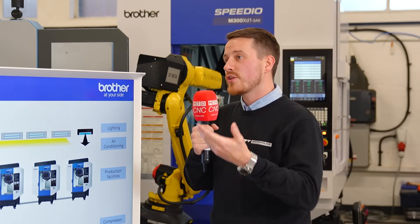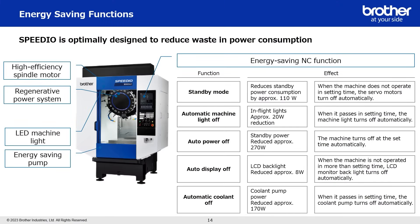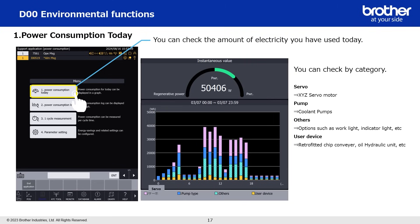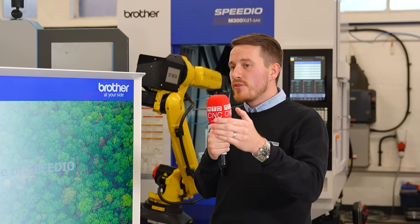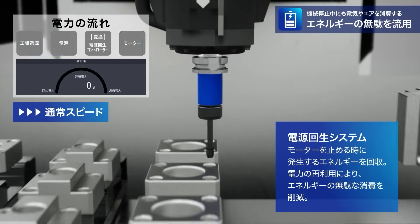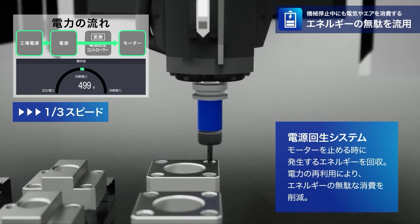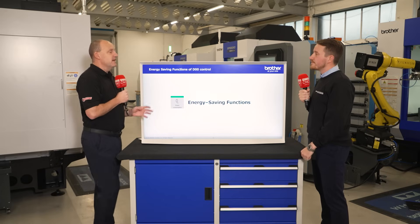You will expect to see a big saving on power consumption because you're not traversing the mass. I've seen figures of eighty to ninety percent saving in power consumption — how is that achieved? One big aspect is the mass: you're not moving a large lump, so your linear rails are not burdened by the weight. The machine also has a special technology — similar to an F1-style car — that harnesses power back as it slows down, putting it back into the inverter technology, which then applies it when it accelerates. So you're recycling that waste energy effectively.